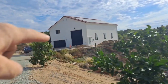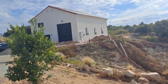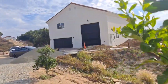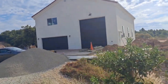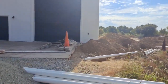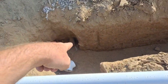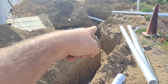Basically, the sewer — whatever's in the sewer pipe: water, toilet paper, etc. — is all sloped out of the house and it's going to go to here, even a little closer. That's going to come out, and it's got a little bit more of a bend than I would have really liked, but it's going to be a gradual bend. So I'd kind of like it straight, but it's going to come out and go right in here, do a gradual bend, go into the tank.